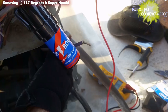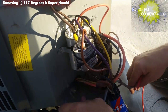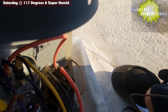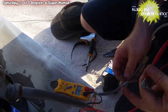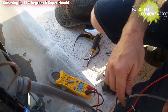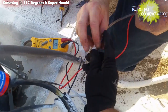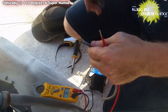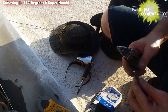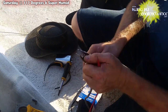The terminal died. So what we're going to do is pull this wire through. I need one terminal end to go to the compressor. I think this side is okay, and on this side we go to the wire and we're okay. The terminal is bad, but I don't have that size, so we're going to run it straight to the screw on the front of the contactor.